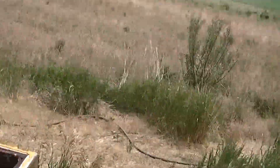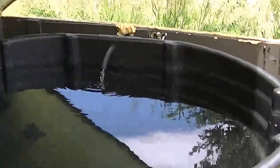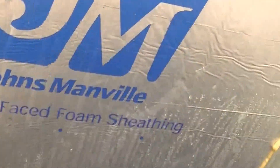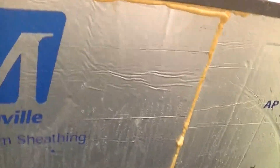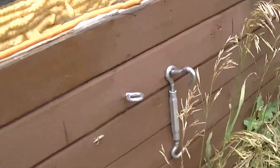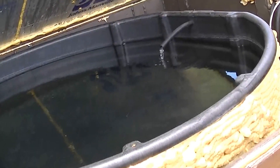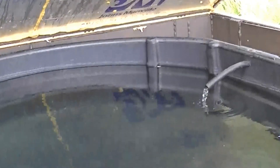I had to leave the whole top open last night for a good 45 minutes — it was just too hot to get in. So it seems to be working very well, does not lose much heat. That ugly but effective insulation job, this enclosure I have — I added a couple of extra sheets of foam insulating board, leveled the tub, and got it up to a height where when you drop that lid down it makes pretty good contact with the top of the tub, and then I cinched it up with a couple of turnbuckles and that's my lid.